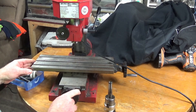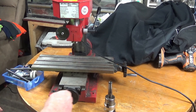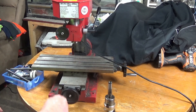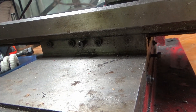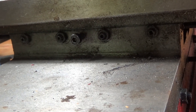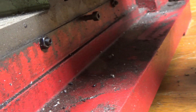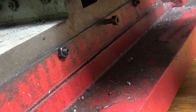That then brings us to the backlash, which is every bit as horrible as you could possibly imagine it would be. To remove any play in the table, you need to tighten up these grub screws. Unfortunately, to remove the play out of the table, you have to tighten up the grub screws so much that you can't even move the fucking table anymore. Everywhere that you need to control the rigidity on this is just grub screws.